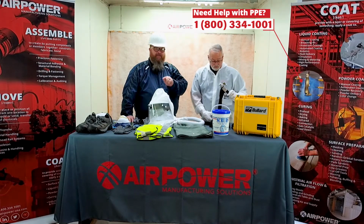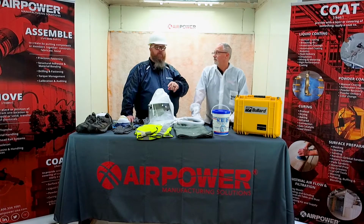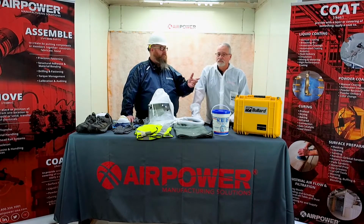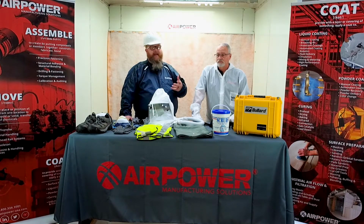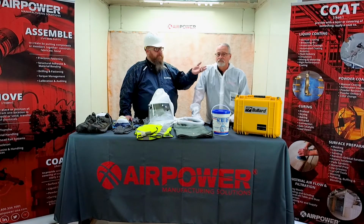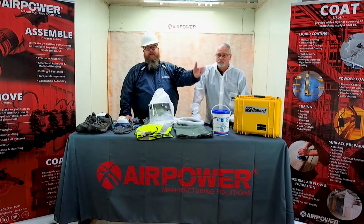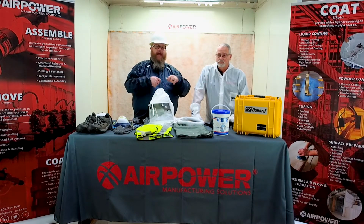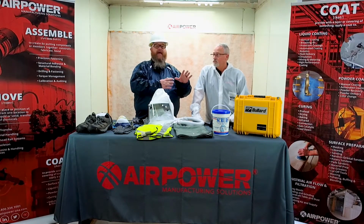And they are different connectors than your standard connectors that come from your air compressor lines, and there's a reason for that. You can die from the inhalation from the air source coming from simply a standard line, a standard hose coming from an air compressor. And these units use a different set of connections so that you'll never accidentally go and connect the wrong thing in your plant, so that you always have that clean air.